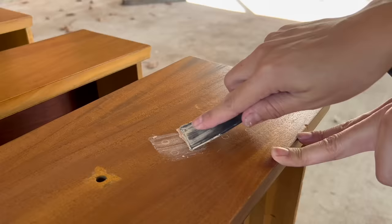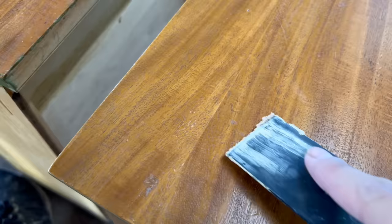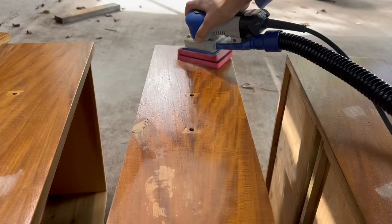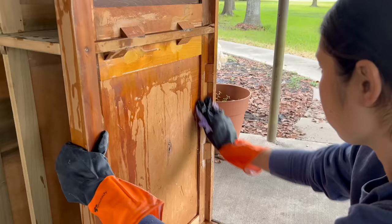Some of the drawers also needed some wood filling. There were a few spots where the old finish had cracked and was raised, so I sanded those back down smooth just so you wouldn't see the difference once I painted over it. While the piece was on its side, I took the time to clean the bottom before coming back and sanding down the wood filler.